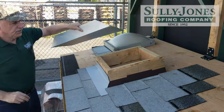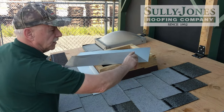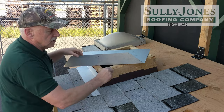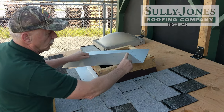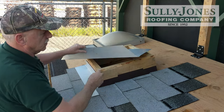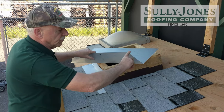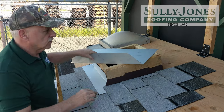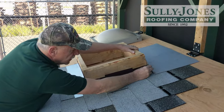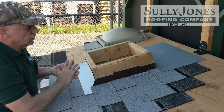Now I'm going to cut the saddle so it comes out at least three inches — you can even go four. This is four inch by 14 inch, so a 45-degree angle would be cut just like that. If you want to come out a little further, you just cut a lesser angle. The entire angle is on the outside on both sides.